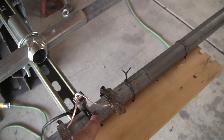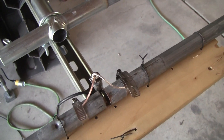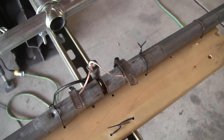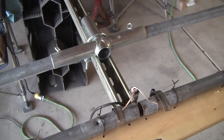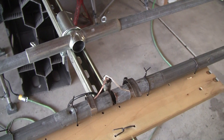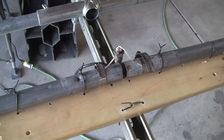Sometimes there's an inch, sometimes a two-inch gap between the two. I just laid it here — I didn't care, I just wanted it in place to see what I could do. Maybe I can change that a little bit. The feed can have a huge impact on an antenna. When I used to design 2.4 GHz stuff it was a massive, massive improvement, but you know we're talking 11 meters now so it takes a lot to make a change.